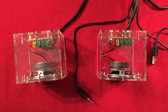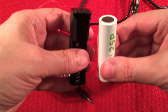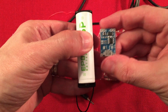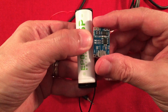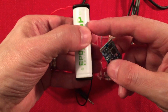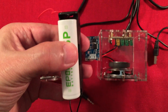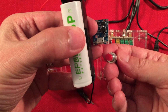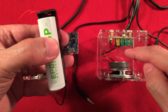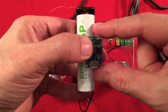And that includes something like an 18650 battery holder with an 18650 battery. And of course, you've got to protect that battery with a power protection board and charging board to charge it. And you'd build a box or buy a box that maybe has this with a switch, which is what you need. You need a switch also. So you need these to make a mod. So your on-off switch, so you don't run your battery dry, because this is on all the time. And then you have your charging board and your 18650.